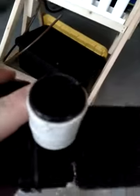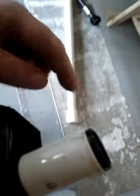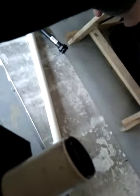And then this one here is probably the tricky bushing. It's designed to actually press onto a piece of 3/4-inch fitting. So you'll notice that this fits right onto it, and that's a coupler. So it's a 3/4-inch diameter pipe. So what people do is they take these, they buy them, they push them into a 3/4 pipe, and then they glue it. And then they can go right from 3/4 pipe to the drip pipe.